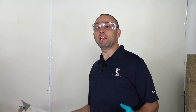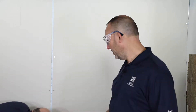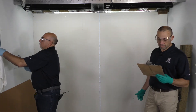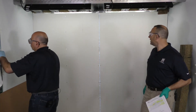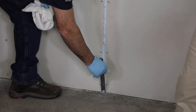If this was a two-, three-, or four-hour wall, we read down this system and we would actually need a one-inch depth of sealant in that joint there. Eddie's going to go ahead and tool it in — just a best practice to make sure that you get a nice finish and good adhesion to both wall substrates.